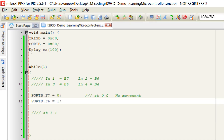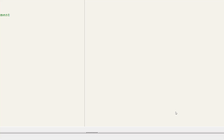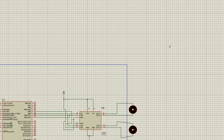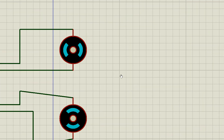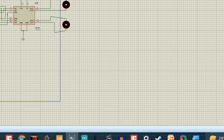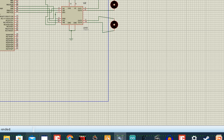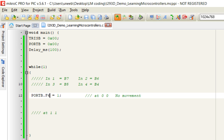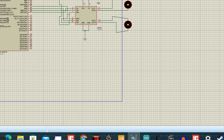To simplify: I only write PORTB.F7 equals one and remove the other command, because the other pin is already initialized to zero. The motor moves in one direction with just one pin set. Only one input needs to be one and the other zero to make the motor work — this optimizes your code.